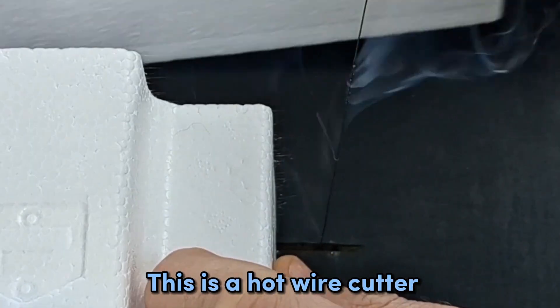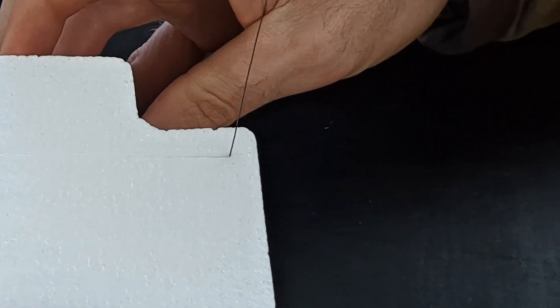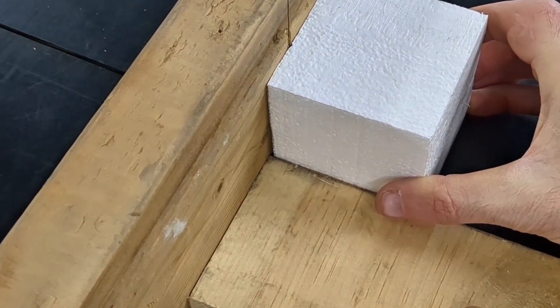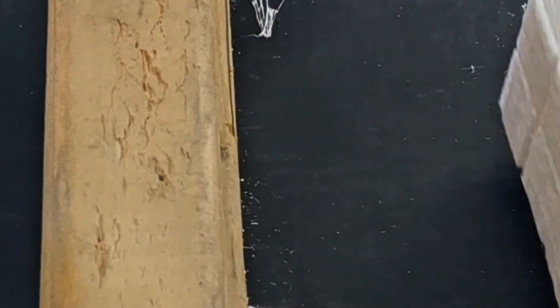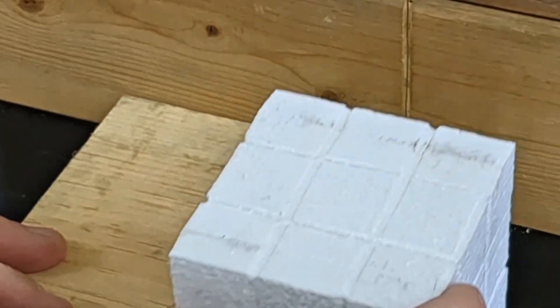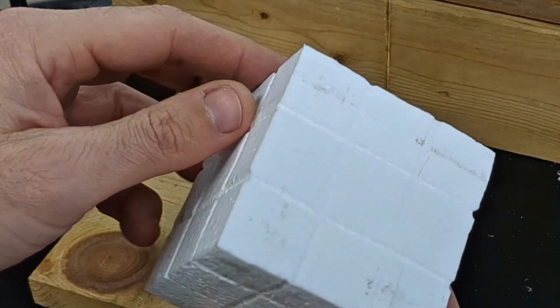Since I made this pattern a long time ago I didn't film it, so this is a clip I pulled from my last video where it failed. This is how I made the square by cutting out the polystyrene EPS foam using my hot wire cutter. I cut out a three-inch square, then I put a piece of wood behind the burner so I could easily press the foam up against it so it burns a groove into the foam. Doing it this way allows me to have a uniform groove all the way around. After this I'll glue a sprue on it for the molten metal to flow into.